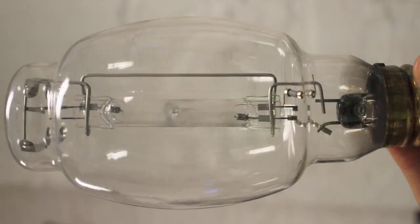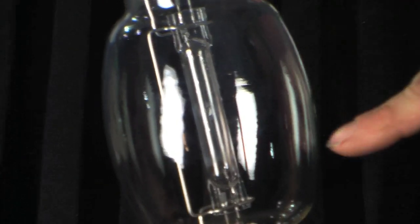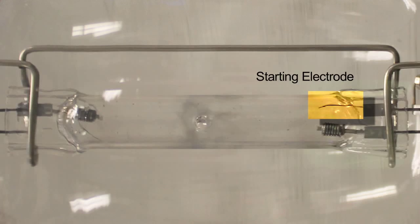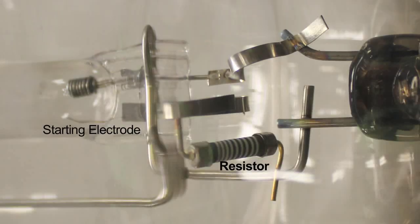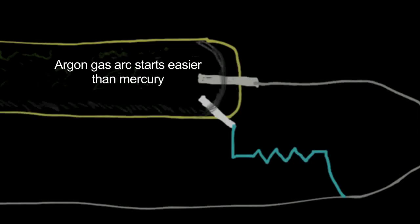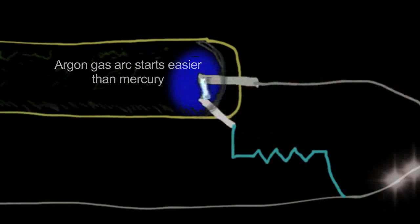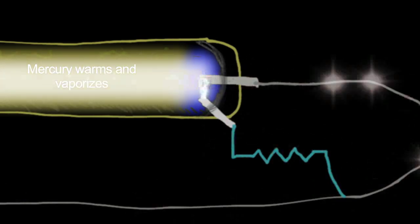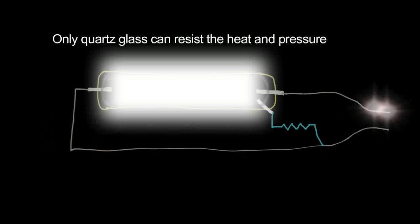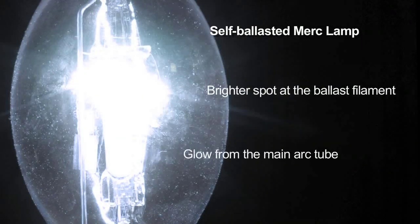The clear mercury vapor lamp really shows how the lamp operates. Similar to the metal halide, it has two operating electrodes which are clearly visible, and a starting electrode which is much tinier — a tiny little piece of tungsten wire. The starting electrode reduces the amount of voltage necessary to start the lamp because it's so close to the main electrode that it sets up a little voltage and strikes the gas. Once the gas ionizes, the arc strikes and the lamp runs — the starting electrode is only there for starting. Once running, the arc runs between the two main electrodes strictly through mercury vapor; there are no halide salts in the lamp, so it's strictly a mercury discharge at medium-high pressure inside the arc tube.